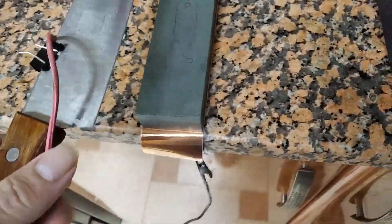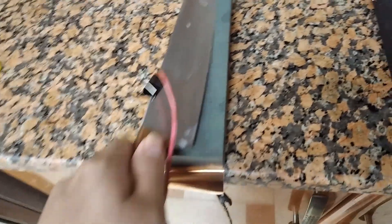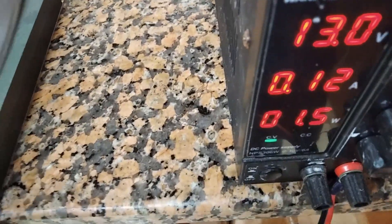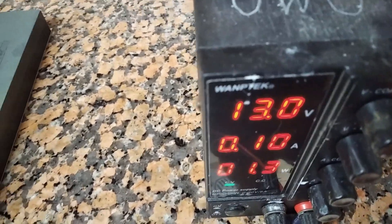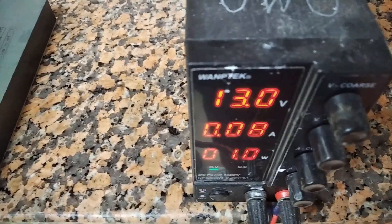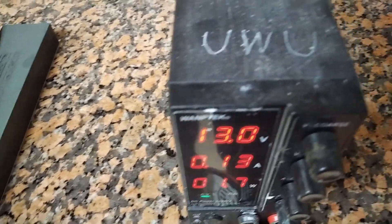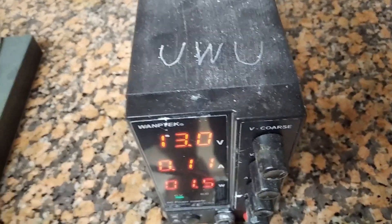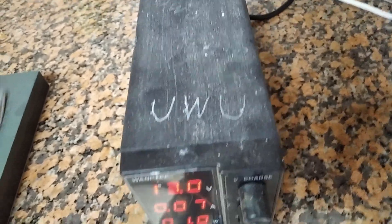This is a technique known as electrochemical or abrasive grinding. It is used to sharpen. And as you can see, whenever I sharpen, there's a little bit of current running through. This is very important. What we are in fact doing is we are generating metal oxides at the anode, which get oxidized and rubbed away by the wet stone abrasively and continuously.